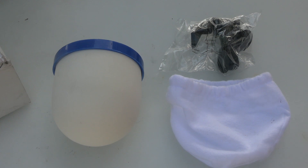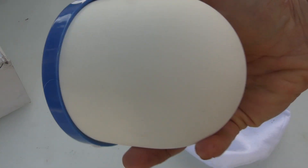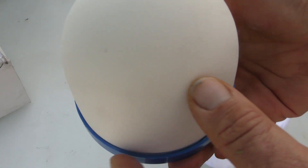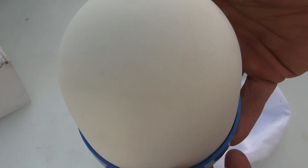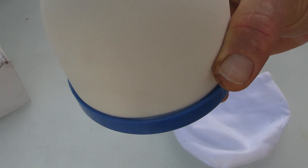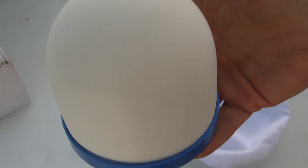I was completely shocked when the guy from Just Water told me there are copies of these filters out there. The copies are fine but not quite up to the same spec. You can shake this filter and hear the carbon inside — that's important if you have chlorinated water or you're worried about fluoride. We have septics here so the groundwater has a lot of prescription drugs in it — birth control pills, blood pressure pills that don't break down. The treated carbon inside is a special formulation; check their safety data sheet on their website for what's in it.